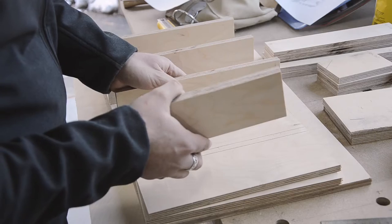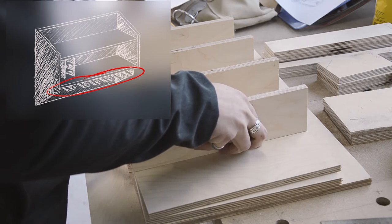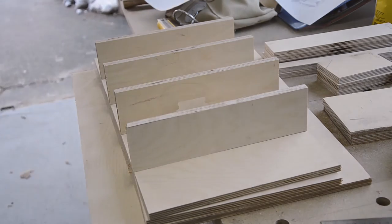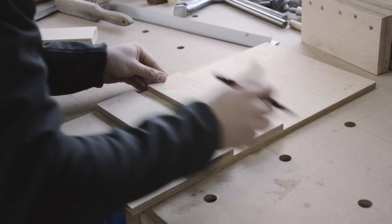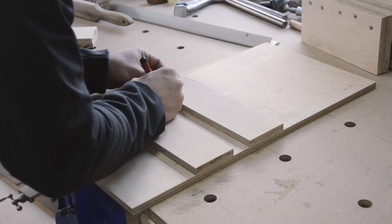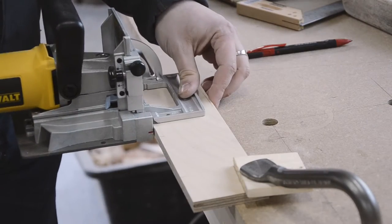This will be the lowest part of the module, where the cordless screwdrivers will be hung. For this I have five little planks, which run into a board at a 90-degree angle. I want to try not to have any visible screws and use flat dowels. So I'm busy milling the slots for the dowels for a while.